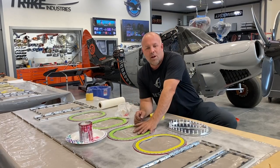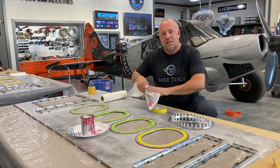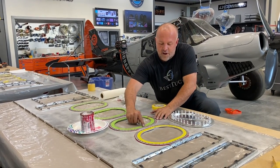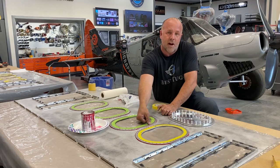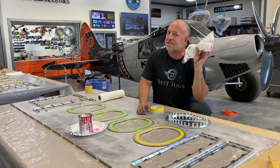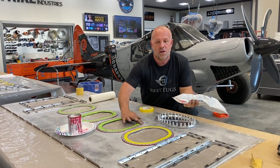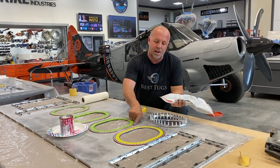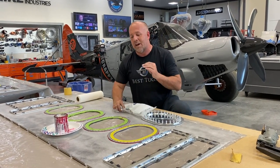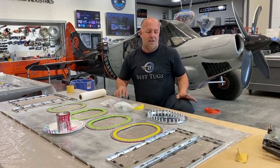And now what I'm gonna do is go through and sand and clean this up. And I'm gonna use this product, which is a two-part. I'm masking this off here and out here. I'm gonna cover the heads of the rivet and this joint with this one, and this is really thick. This one will build a perfect bridge over top of all these rivet heads, fill in a nice feathered seam around this hard 90, and it will give it a second layer of protection for leaks. So I'm gonna go ahead and do that right now.